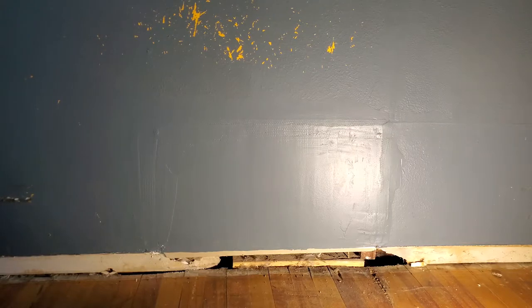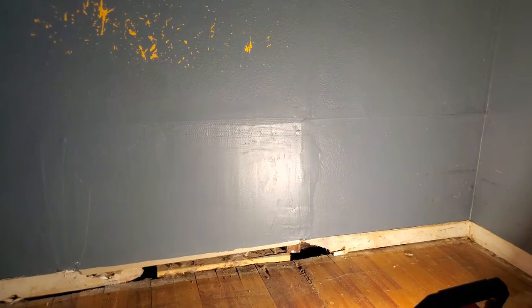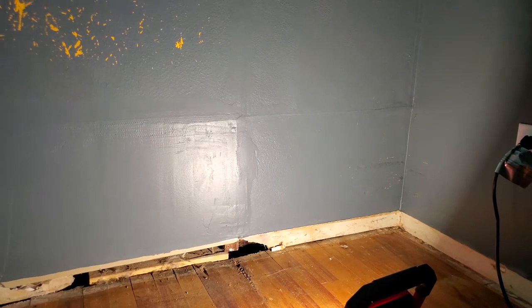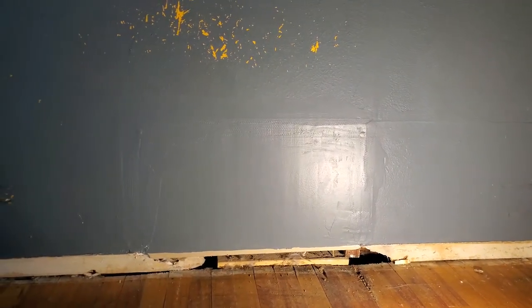As I was taking up the baseboards in here, I realized there was a significant gap down at the bottom of the wall for the drywall — and one of the studs over on the right side is almost floating, which doesn't make me feel very good. I couldn't notice the wall was actually patched right there until I could see it in better light. I know the subfloor in the bathroom was replaced at some point and this could have been part of that repair. The seams aren't up to standard — it's kind of a sloppy job. There's also the outline of another patch about the same size over here. I'm going to assume both were part of plumbing issues. Whenever I come in and start re-plumbing the house, we'll open up that wall cavity and see what's back there.